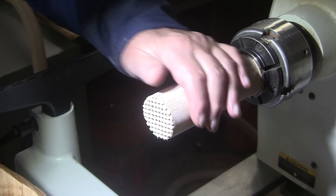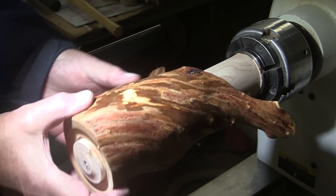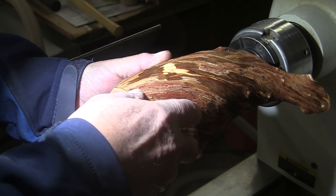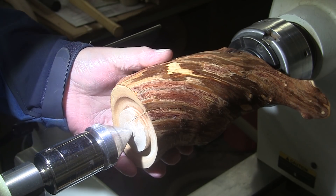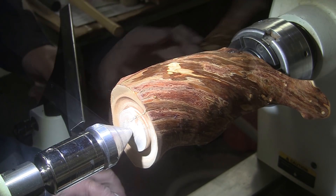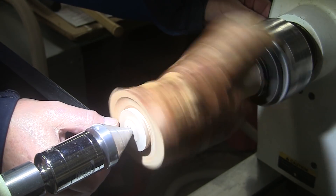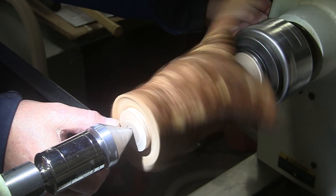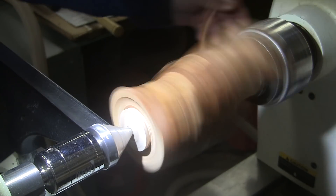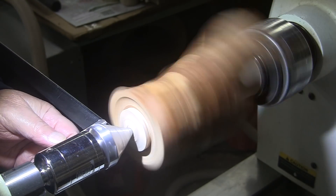I made a new block of wood and put a non-slip material on it so that I can place the vase over that and bring up my tailstock to get rid of the tenon. I still have the center hole there for reference. I'll apply a little pressure, bring up the tool rest, spin this up a little bit, hold my fingernail against the tenon to make sure it's hitting equally all the way around — and it is. I'll turn the speed up to about 600 and take this 3/8 inch standard grind bowl gouge to remove that tenon.